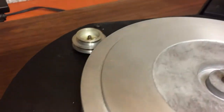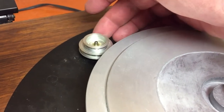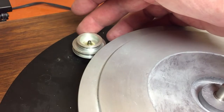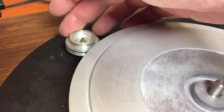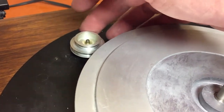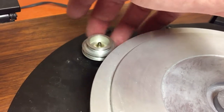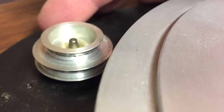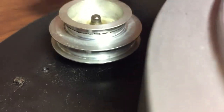On this particular motor with this click, when I pull the power plug from the wall, that feeling of it being energized goes away. This motor is noticeably tight — I can feel what almost feels like the bearings in a detent in there. I don't know if it's just grease that's tight or old grease not allowing it to turn smoothly. It's definitely not smooth. If I give it a spin with my finger, it immediately stops — it doesn't even pretend to coast.